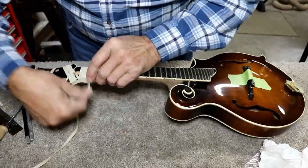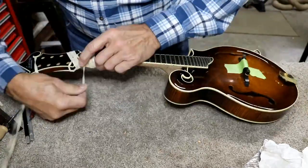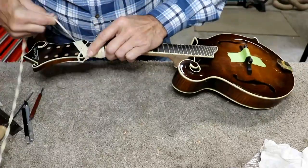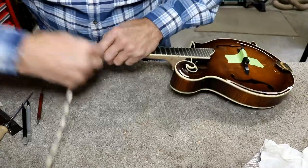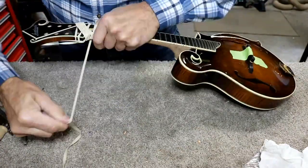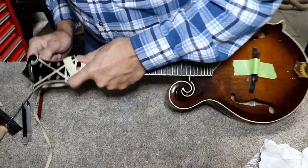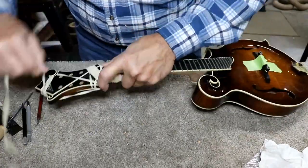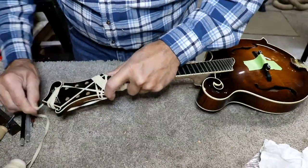You can take these things to an extreme, but it's hard to go to an extreme when it comes to clamping or tightening down things for glue. More is generally better. I don't worry about the people that say you're going to squeeze all the glue out. I have never, ever gotten close to that. And I always squeeze every joint as tight as I can.